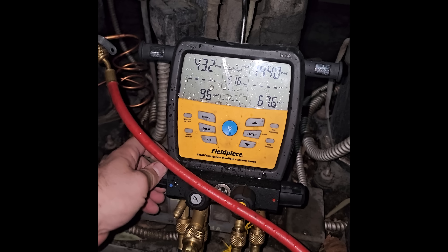I went down to my van to grab a dual pressure control — and I didn't have one. I'm like, 'For real?' So I said, just give me a high pressure and a low pressure — sometimes I have those. I only had a low pressure. I do not have an individual high pressure. The system needs a low pressure control to run because it's a pump-down system — you should always have a high pressure safety on it too. I took a risk — I don't encourage any of you to take this risk — but I ran it without a high pressure control. I didn't want to open a supply house, it was only for a couple of days, but there was still the potential for compressor damage if a condenser fan motor stopped working. Do as I say, not as I do.